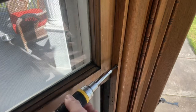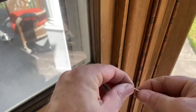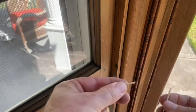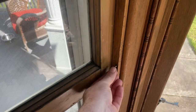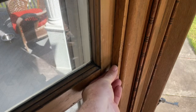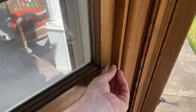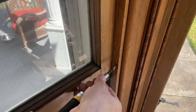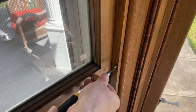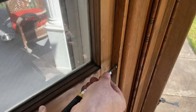Here's a random semi-pro tip from this project: if you have a screw in your house or an old piece of furniture and the hole is stripped out, all it needs is a little bit of material in the hole to shim it up and give that screw something to hold on to. Here I'm using a toothpick — for a larger hole, a matchstick works too (take the match head off). The toothpick worked great, and now the screw has something to bite into and pull that trim piece tight.